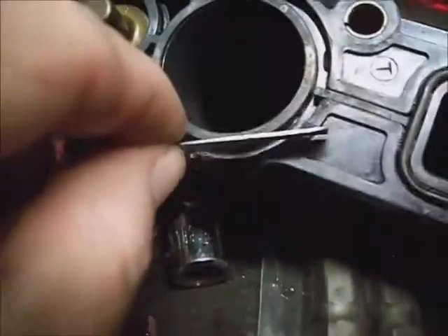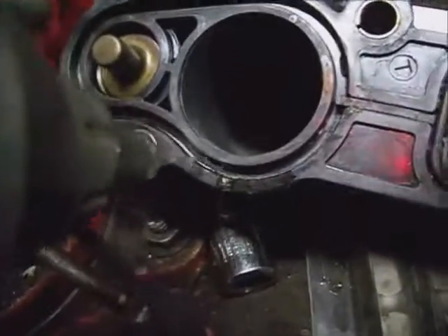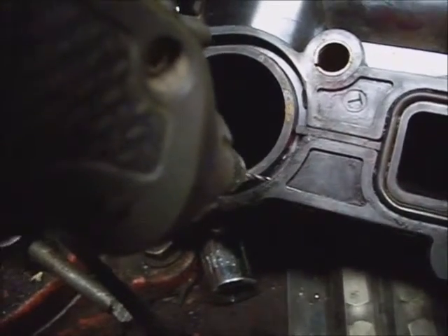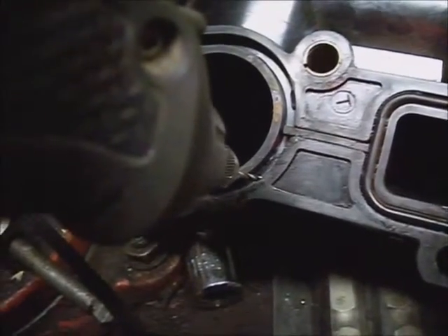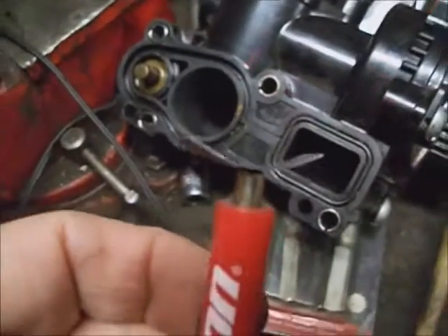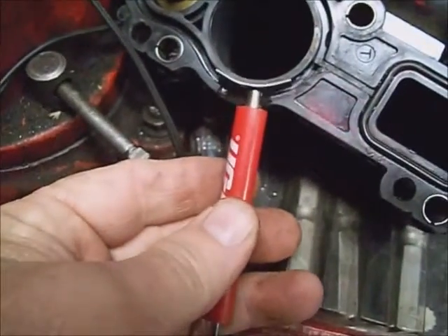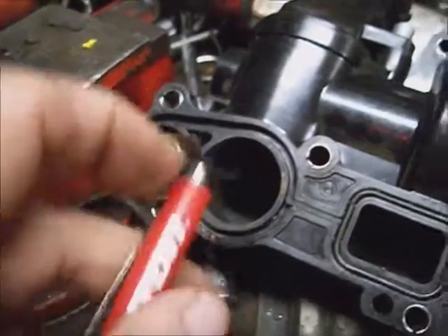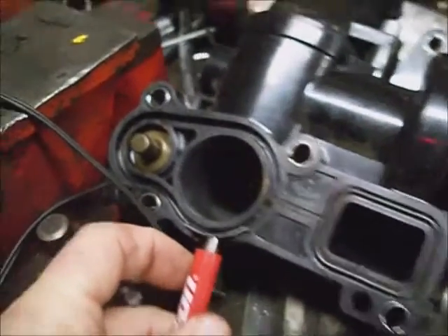Using a Dremel tool, I'll put it down in there and make a starting point straight up and down, then carve a trench across to the other side, just into it a little bit. Then I'll lay this piece of metal down in the trench and use some adhesive that gets kind of rigid but still flexible underneath and behind each side of the back of the plate.